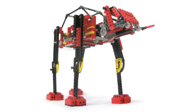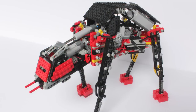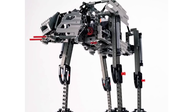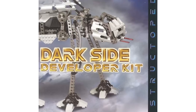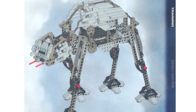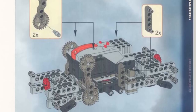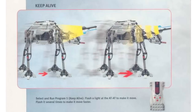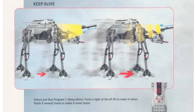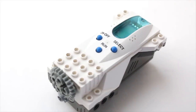I've actually built and rebuilt this robot multiple times, making it a little bit better each time. I started from one of LEGO's own designs — the AT-AT from the Darkside Developer Kit. I never actually owned this set, but when I found the instructions online, I just had to build it. However, the design was somewhat unsatisfactory. Its single motor could only move the robot forwards and backwards in a preset pattern. I wanted it to be able to walk and shoot, but I only had one motor and it could only power one thing at a time.